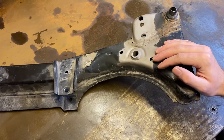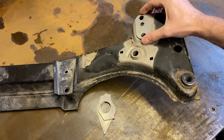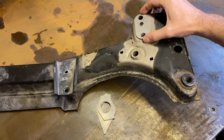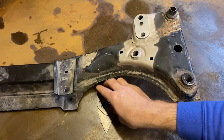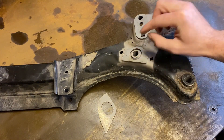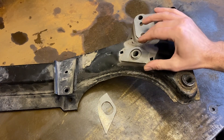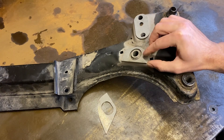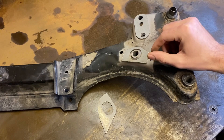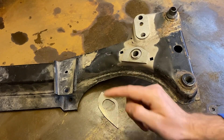Might be a little bit on the plates, which are here. So there's three to do in total — there's that one that's going to stick on there, so that's going to be a full run round, line them up with the holes. There's this little one that's going to sit round that mounting point — we'll put a nice run round the edge, probably one around the middle, we'll see how it welds, because there's already a weld there, so it might be a bit iffy. And then there's a piece on the other side of the subframe that we'll see very shortly.